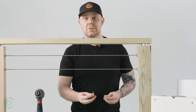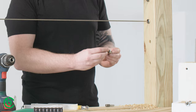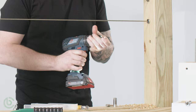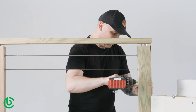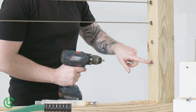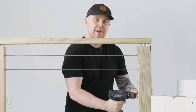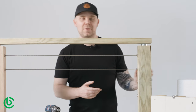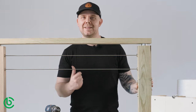Next, once we've drilled our holes, we have a bullet driver. This is a custom piece that we've made to fit exactly in the keyhole opening of every Cable Bullet tensioner. We're going to chuck that into our drill and then use this to drive the bullet into the post. If you want all of these keyholes to be lined up in the same direction, you can either use the drill to do that or you can grab a socket wrench — you're going to use a 7/16-inch head on that. As we mentioned before, you're going to use the same tensioner on both ends of your cable, so we're going to repeat the process on the other end and pick up there.